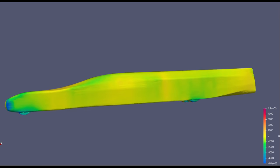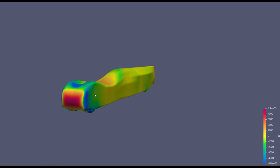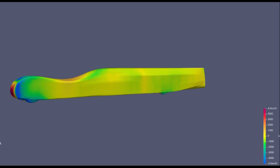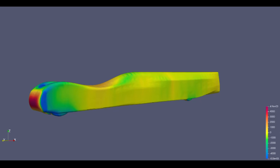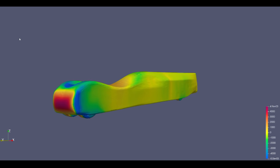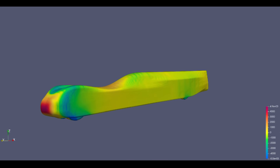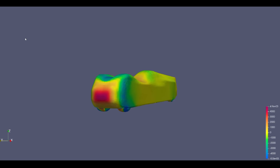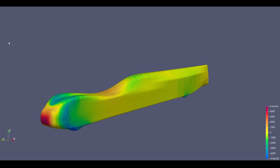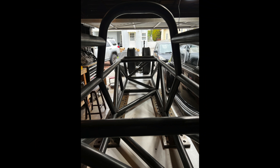The smaller diameter front wheel had the lowest drag — its coefficient came out to about 0.156, and the larger wheel body came out to 0.174, with a similar difference in total drag force. There's also a smaller frontal area with the smaller wheels, so the total drag force is about 10% better. But looking at the body with the larger wheels, you can see the pressure profile on the front has a lot of really fast, low-pressure air on the sides, and some flow up top that doesn't look very clean. So I did a super quick redesign of the nose and ran another simulation — the drag dropped about 6%, more than half the way to the smaller wheel body. I can tell there's more to be gained with some redesigns of the nose, so I decided to go with the rubber tires up front. They have more grip, they're more stable, and apparently a lot easier to drive on, especially at El Mirage. I'll be diving into aerodynamics further in a future video.